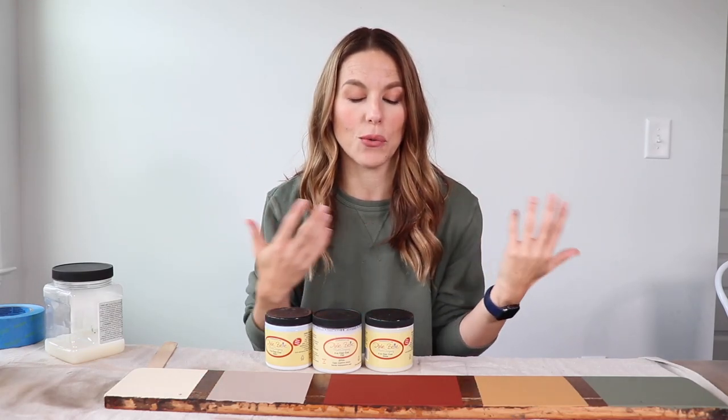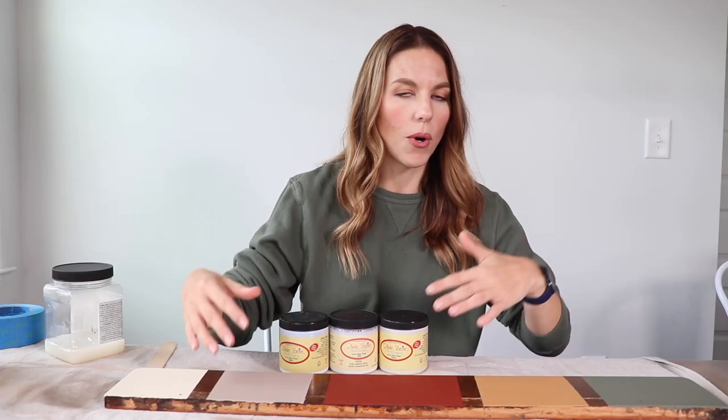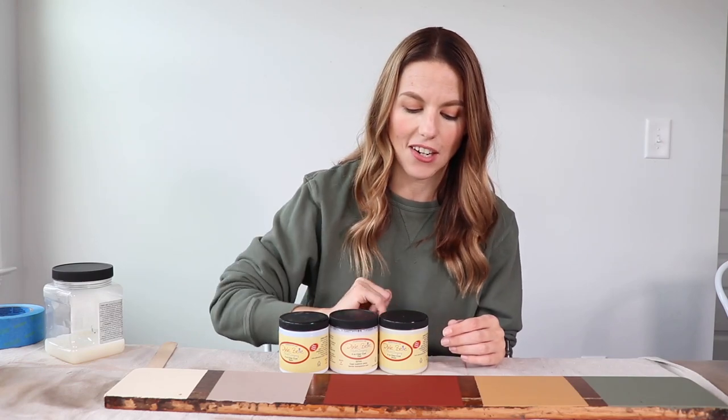Top coats can be very confusing — I get lots of questions about them and I have tried all of these. I'm going to give you my opinion of which ones I like and why. Let's start with the clear coats. This is one of my favorites for beginners — I think it's the easiest to learn and it's going to give you great protection. These are all water-based polycrylics, so they're going to give you a crystal clear finish, they're not going to yellow, and they work well with the paint because both are water-based. You're not going to have to wait a long time for these to dry. You guys know flat is my favorite — I've used satin a couple of times, and I think satin is the most forgiving for a beginner. I've actually never tried gloss, so I'm going to put that on as well.